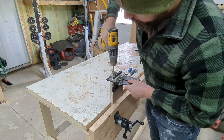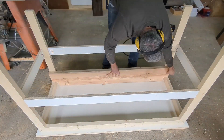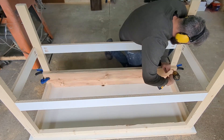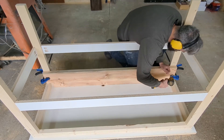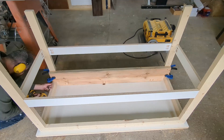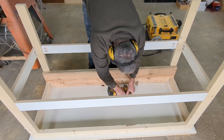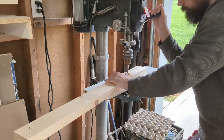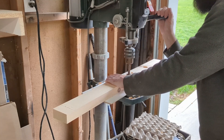I saw this design about seven years ago by Jay Bates and thought it was a great idea. I'm beginning by screwing on a scrap piece of 2x10 that I cleaned up with the planer. It's going to give me some additional support and I made sure to screw it into the legs and the existing apron. The table is built with glued half-lap joints with some screws for reinforcement. I'm drilling some 1 and 3 sixteenths inch holes to hold the 3 quarter inch pipe, which has an exterior diameter of about 1 inch.